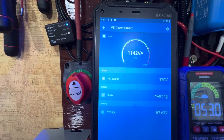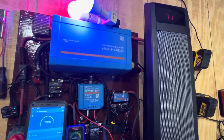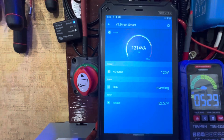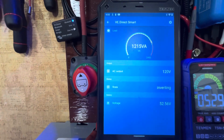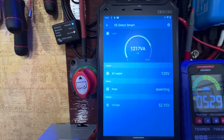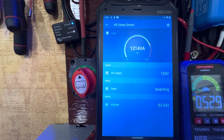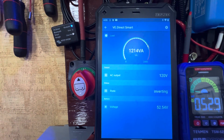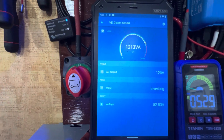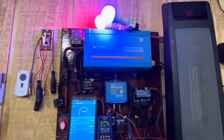It's going to go on up because the heater is starting to get warm right now. As you can see, the heat is set on 71 degrees and it's steadily going up. It's a 1200-watt inverter, but actually it's putting out more than 1200 watts — it's at 1217 watts. And there's no problem with it; it's not giving me any kind of overload protection alert. It's putting it out, and like I said, we've got the lights still continuing to run.